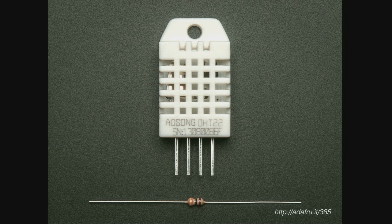The other piece is the DHT22, a combined temperature and humidity sensor in one package. There's pretty good library support, they're easy to buy at about $9, and their accuracy is good. The one drawback is they're a little slow — you can only take readings every two seconds, and readings may be two seconds old. For some applications that's horrible, but for this project we're taking readings every five minutes, so it works really well.